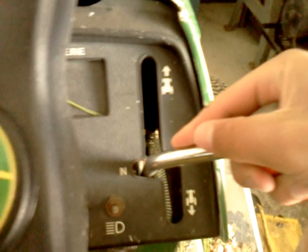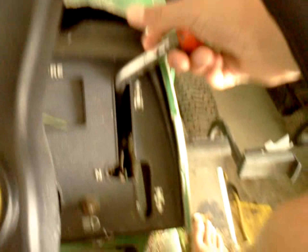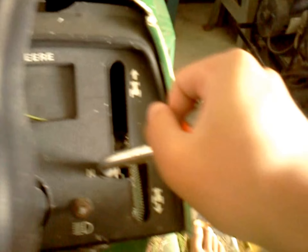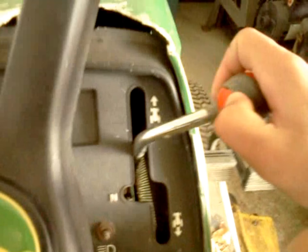There's the PTO, which drives off the front. This switch is for the optional rear power takeoff, which this tractor doesn't have — it's an add-on that bolts to the back of the transmission. Here's your light switch, but the switch broke off and the lights don't work. This is your control for the transmission — it's hydrostatic, just like the LA-150, but instead of forward and reverse pedals, this is what's called a hand hydro. You have neutral, forward, and reverse, which is really convenient so you don't have to keep your foot on the pedals. There's a neutral start switch so the tractor won't start if it's in gear.